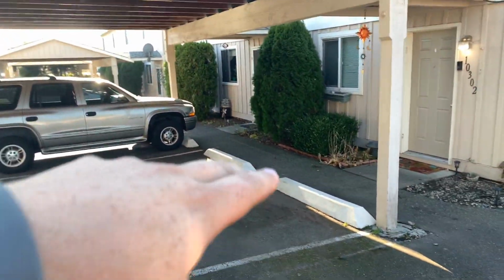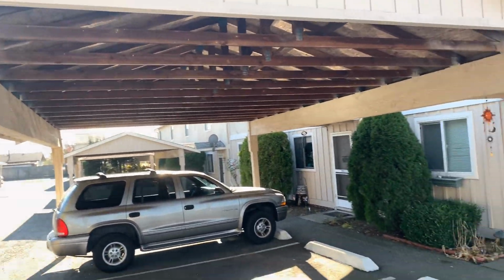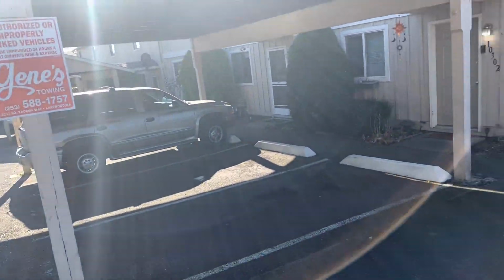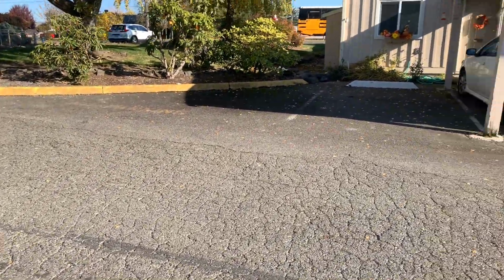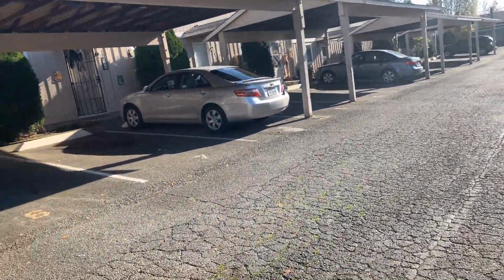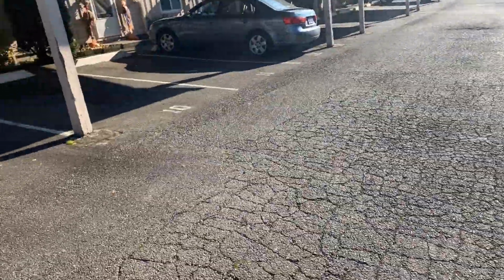Okay, and then as you can see, the asphalt goes behind the carport. These carports are about 9 feet here, but you've got these large beams in the front that are a lot lower. So a Mini X can enter in from the sides of these without a problem, but we do need to be careful out here in the front as we try to take out all the asphalt that goes through here. So now on this revision, it's going to be a complete grind and overlay of the entire lot. The biggest challenge here is getting underneath all these carports. Okay, the other thing is wheel stop replacement. You've got all these wheel stops in here.